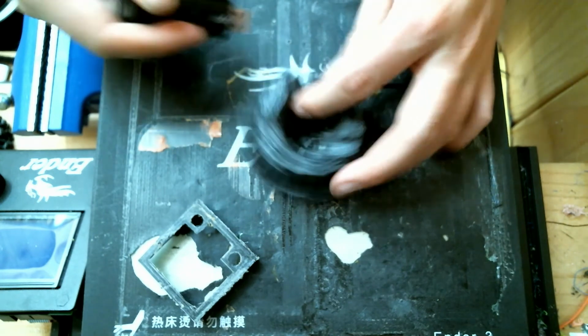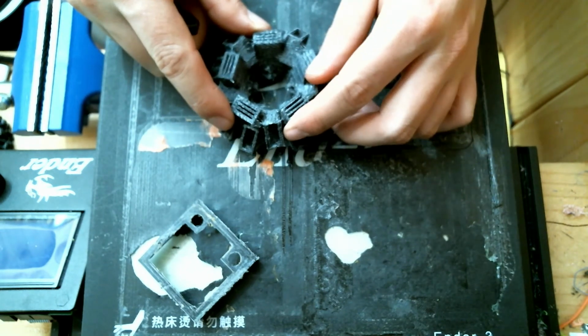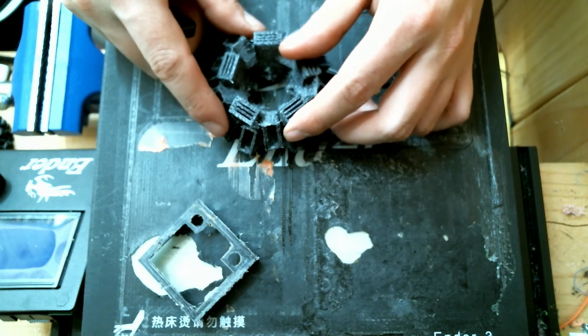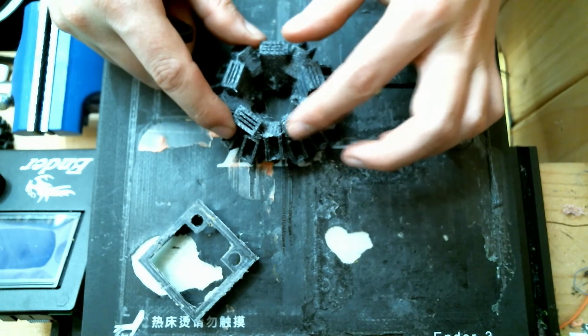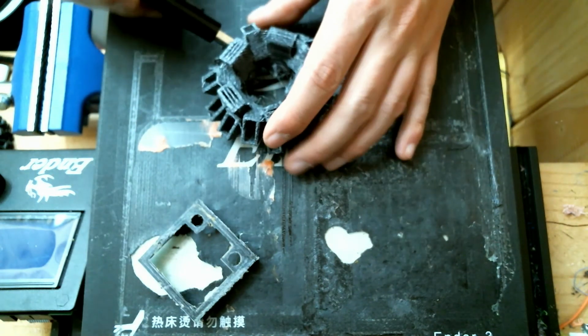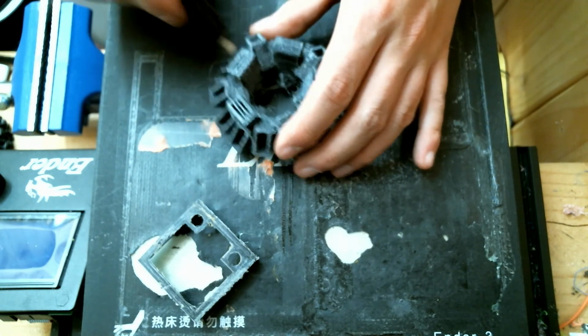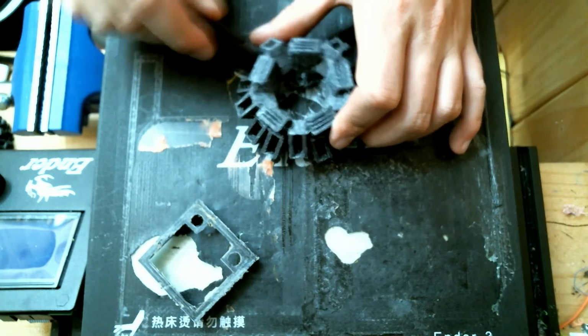And if you have markings on them, you can say, okay, I printed this on this quadrant or corner of the build plate, so over here I have an imbalance, so I have to either crank it up or crank it down. I don't have an auto leveler. I'm not even sure those are that great anyway, but people swear by them. So I can test all this stuff. Like I say, pretty easy.